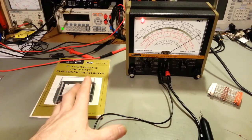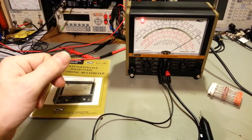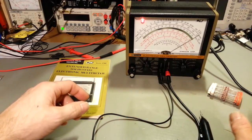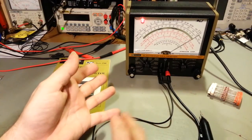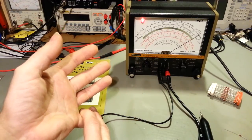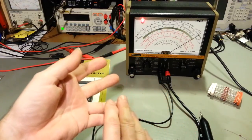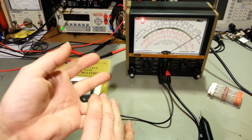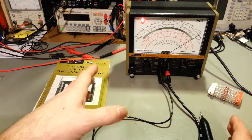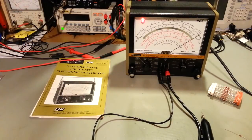Like I say, there are good videos that actually show that. I think Vern over at the Radio Mechanic did one where he actually showed it. He took different multimeters, some of them maybe 10K ohms per volt. A lot of your standard vacuum tube multimeters back in the day were 11 megohms. And if you look at schematics for old electronics, a lot of times that's what they're going to specify. Or it could be different, like I say, but it's just something to be aware of.